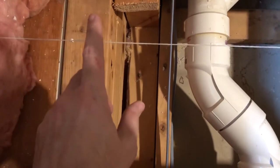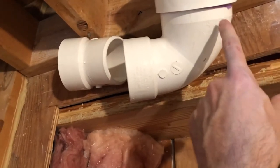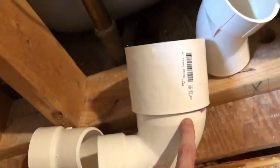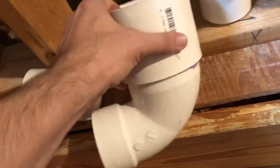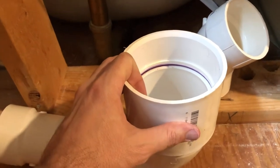I'm working on placing the toilet flange - there are always a few different options to get it as close to the right position as possible. Here's my string - that'll be the center mark going this way. I'll have a 4-inch line coming up centered on that string. This is a sweeping reducer 4-inch to 3-inch, made for a toilet flange. I'm actually using a 4-inch sleeve over the outside of that, and then I'll put a 4-inch pipe coming straight up out of there, right up to my toilet flange.